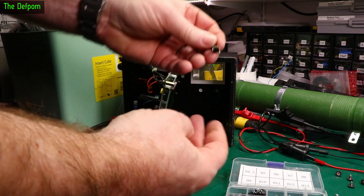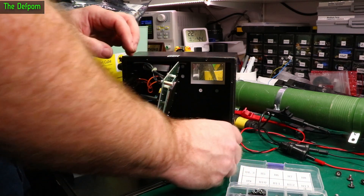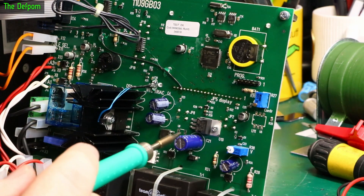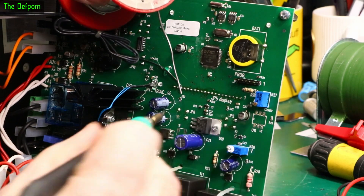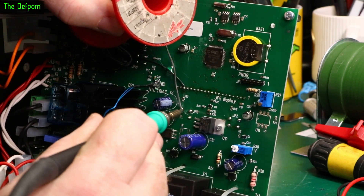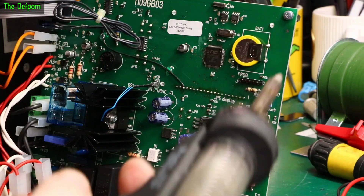I've got my switch assortment here and this one from the assortment appears to be a 13mm switch — the same height as needed. One replacement switch. I'll keep these sorts of things in stock — you always need them eventually. Well, the perk of the switch not being soldered properly is I've only got to desolder three legs now. I'll put some fresh solder on first, then desolder it — the fresh solder just helps it to flow and move a bit easier. Let's see how desoldering works.